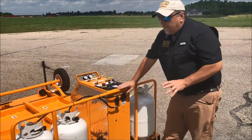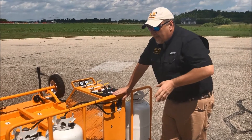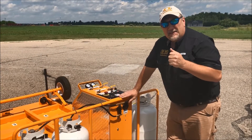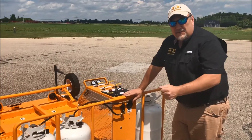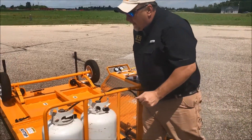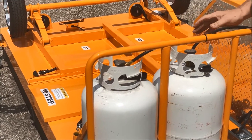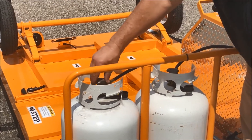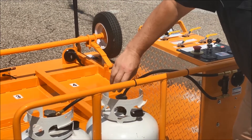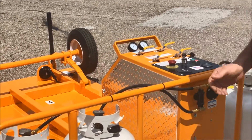To turn on the KM 440 or 448, you've got three 30-pound cylinders. If it's a brand new unit with brand new bottles, they come from the factory full of air. So your very first fill, you must make sure that the propane supplier purges your tank of the air and fills it with propane. If they try to put propane in the tanks with all that air, it's not going to work. You want to turn your propane bottles on slowly, not to activate the safety shutoff valve. One to one-and-a-half turns is fine. If you do hear a click, simply turn your bottles off, wait to hear a click, and turn it back on — that's the safety shutoff valve inside the new tanks.